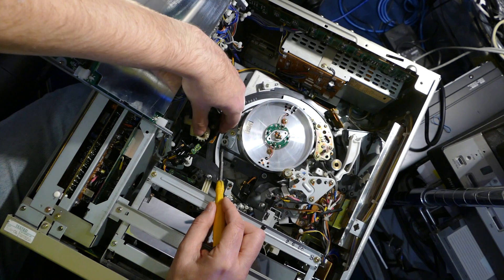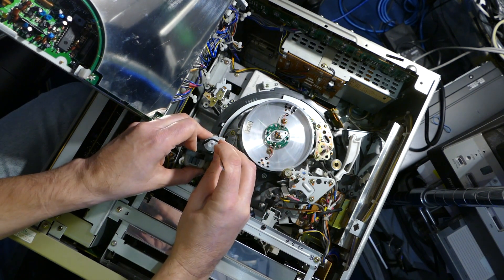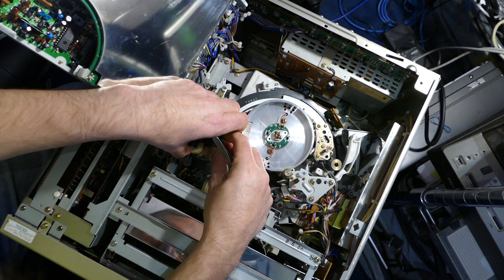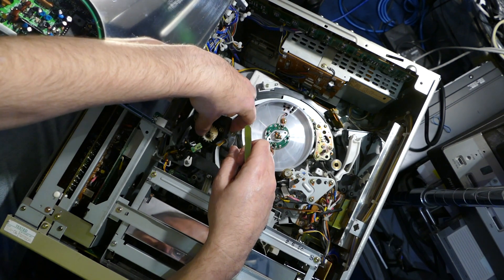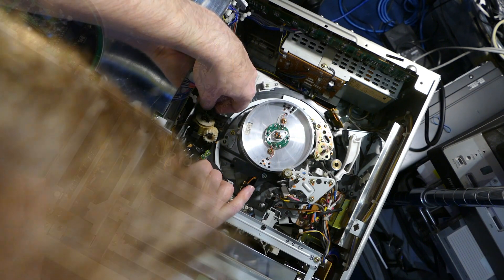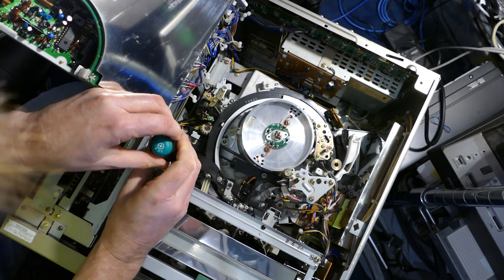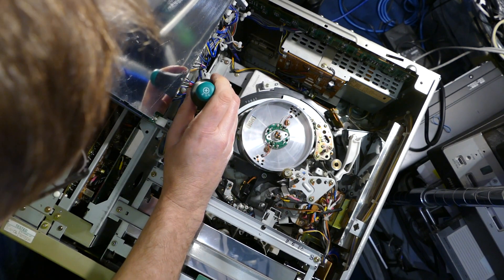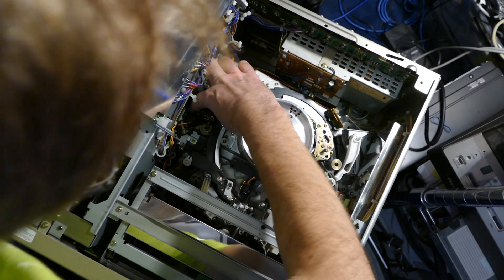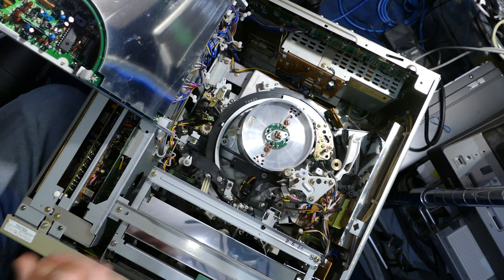When reassembled, the pulley needs to spin freely. Then we need to feed the belt onto the motor pulley — don't drop it onto the video drum. You can see why we moved the head tips out of the way. Then reinstall the whole assembly including the bracket over the pulley. When doing up the screws there is some adjustment available on the back screw — use this to make sure the gear is fully against the loading ring but not jammed too tight. Confirm manually by turning the motor that the loading ring starts to turn properly before finally tightening up the screws.